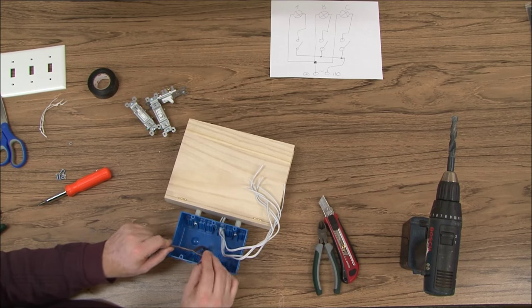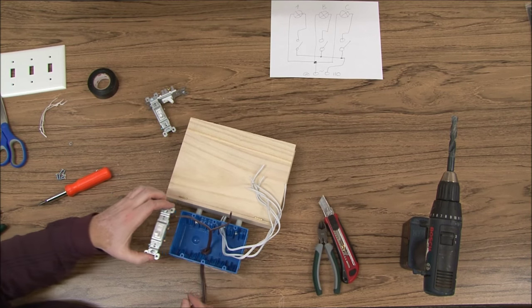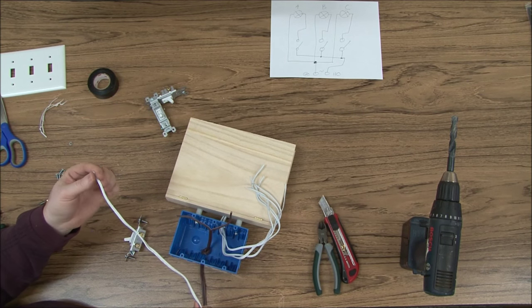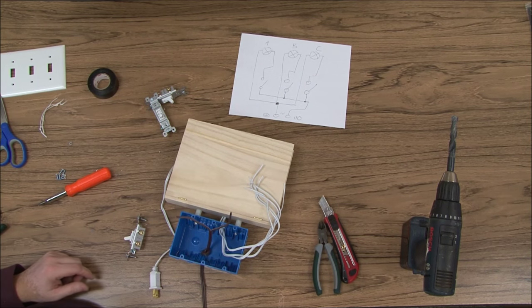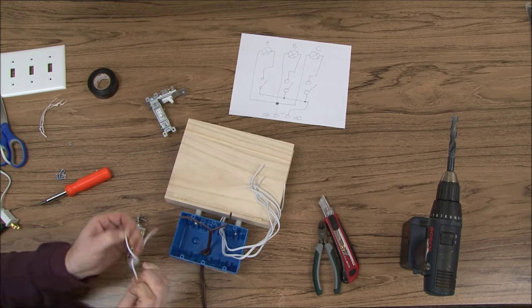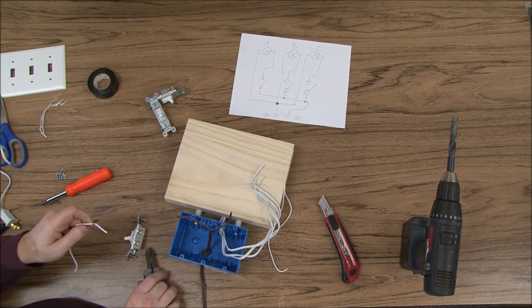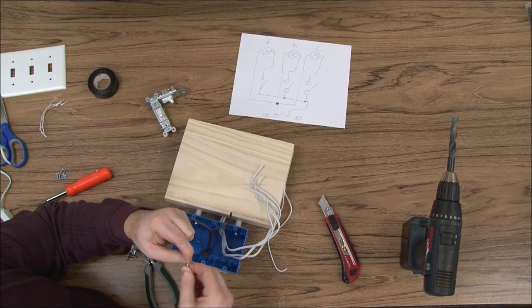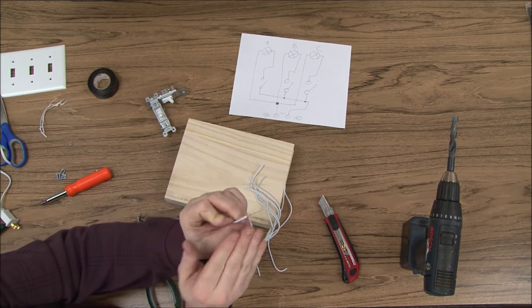All right, now we have to get our switches in order. So up would be on, down would be off, unless you're in England, which is gonna be upside down. And we can use our leftover wires because the switches will need to be connected on one side. So let's see here. This one would work just perfect. Separate. You want to get about an inch of wire in there, and as you pull it apart a little bit and start twisting, because this is a multi core wire, it comes out nice. Otherwise it'll be all frayed everywhere.